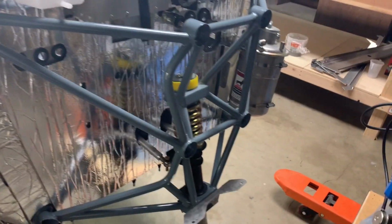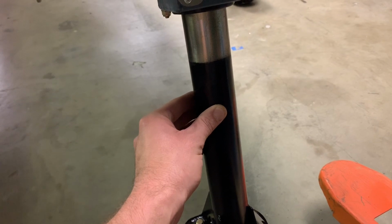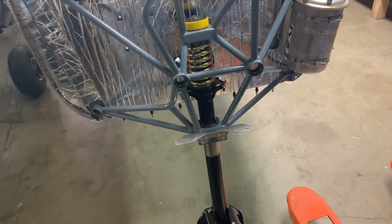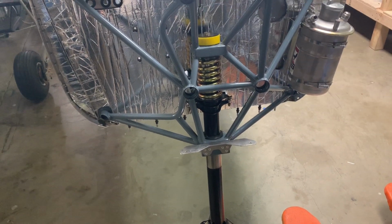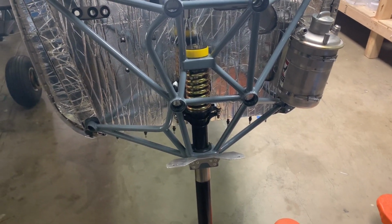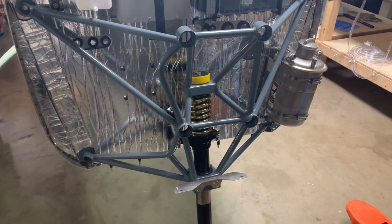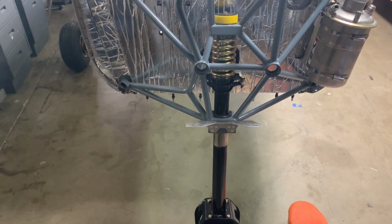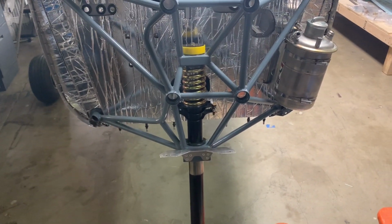So what happened was the powder coating actually adds a little bit of thickness, and so it wasn't fitting through the bushings. It was fitting through the bushings, but it had so much resistance it was basically impossible to move. So I thought about trying to sand down the inside of the bushing, and I tried just a tiny section of it, and they're weird. They don't really sand. It really damages them. They have a nice smooth, mirror smooth finish, and as soon as you sand it, obviously it loses that. So I sanded off the powder coating and it fits perfectly.